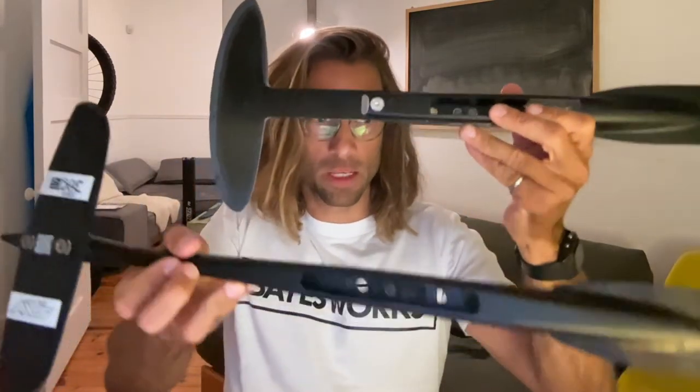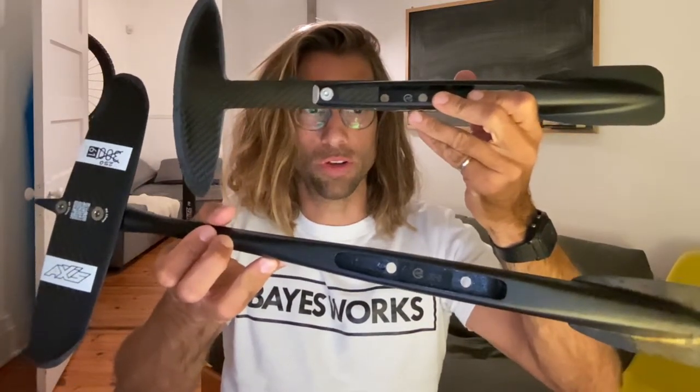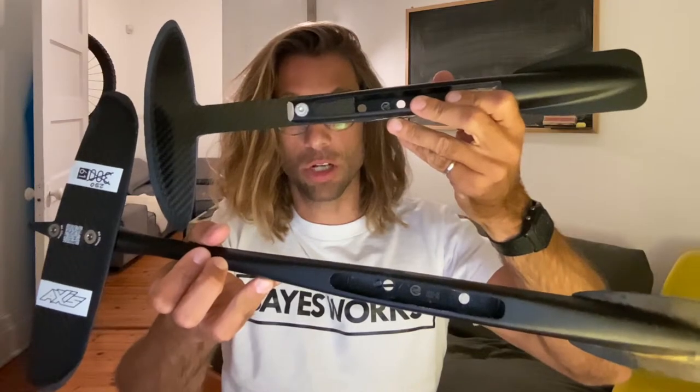The downside — I went too far. The size of the stab is too small. The stiffness of my fuselage is not enough, so it's not stable enough. You can see the stab is much smaller — this one is already a Progressive 300 cut to 250. It's much smaller and doesn't provide enough support.